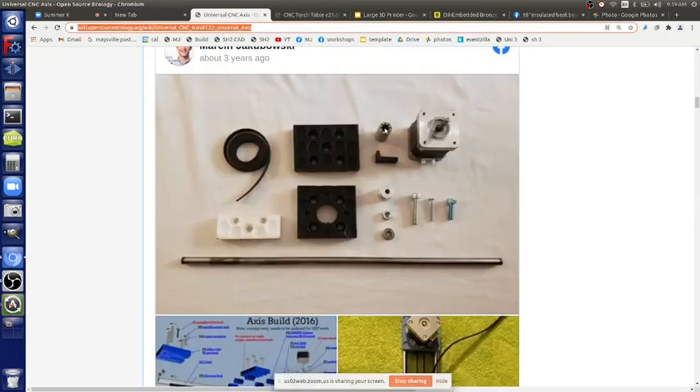The belt pegs are replaced by a belt clamp and belt cylinders — we need to print new versions of those. For the idler pulley we can use an 8mm shaft — the same common shaft used elsewhere like on the universal printer — as a shaft for a 3D-printed pulley. Two skate bearings with a shaft through them, and a 3D-printed piece that spins on that, same as in the extruder.